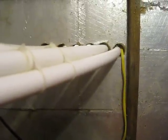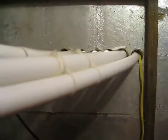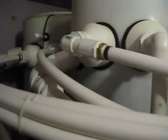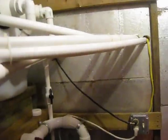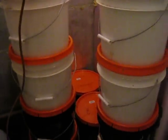Got rid of all the manifold lines in there, all the valves. It's just too inconsistent. Just never did work right from one day to the next. So I figured this was going to be the best way, just to go from a big volume of water with a dedicated line right to each tank. Works out real nice. Size of the line dictates what the flow is to each tank. No valves necessary. Fish feed storage, just got five different sizes of Aquamax in there.